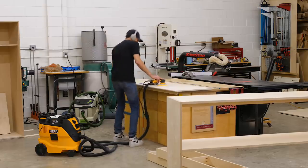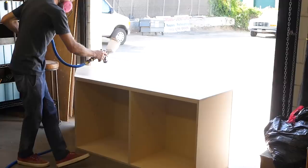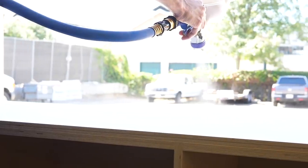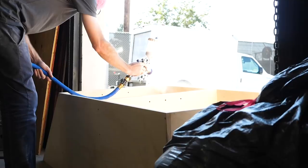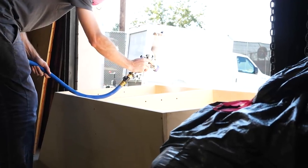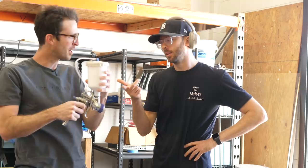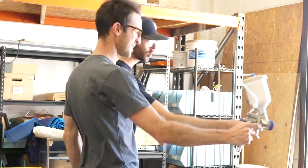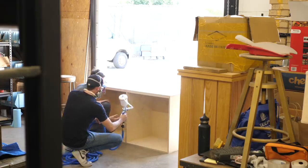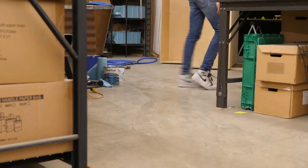There was a lot of sanding and finishing to do, so I worked on sanding while Sean started the finishing process. We decided to spray on a water-based polyurethane, which I prefer for plywood projects with an exposed edge, and we probably spent a good day and a half spraying and sanding, ending up at about three to four coats on everything. This was a great opportunity to work on spray finishing — a technique I've used plenty of times but don't consider myself an expert at. Even with one bonehead getting quasi-instruction from another bonehead, we were able to get a nice looking finish with relative ease. Two heads are always better than one, even if they are just made of bone.